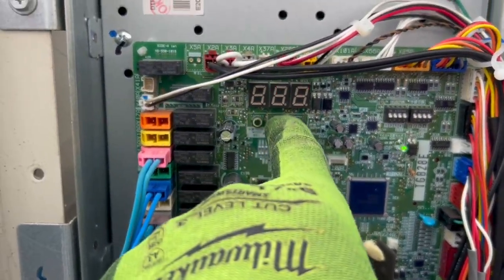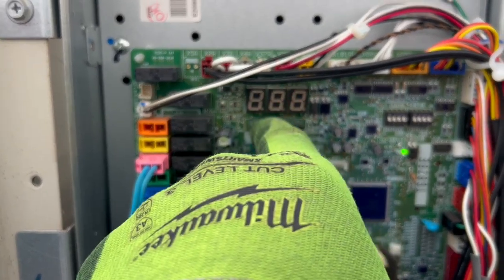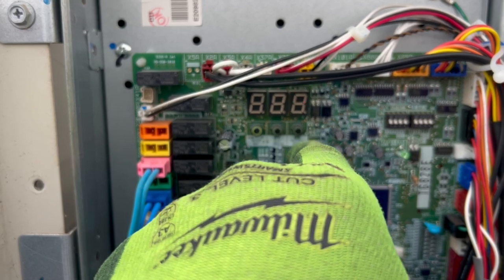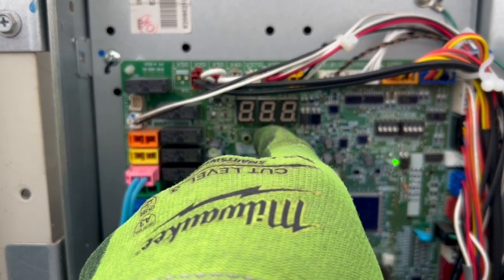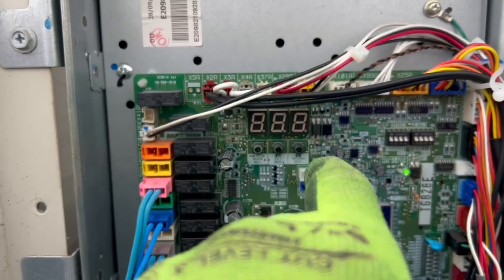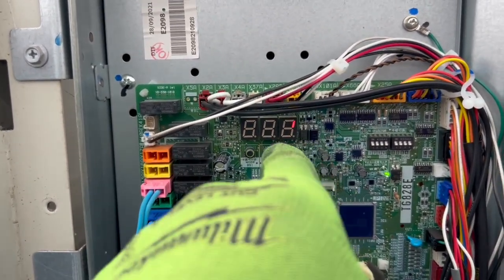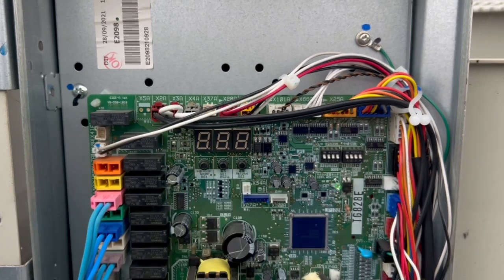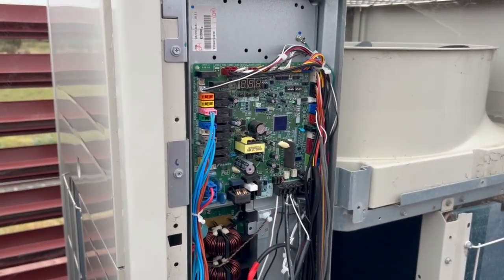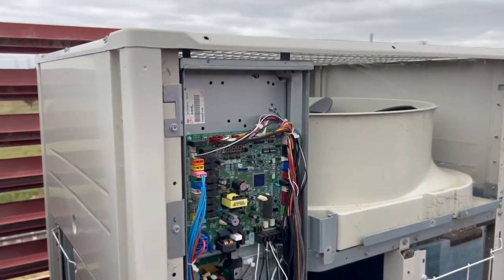On this one, that address is 9-9-2 - yes, okay, so this is the one we're looking for. While I'm here: mode 1-10, number of indoors expected is 10, and we have 11 present. So 1-10 is the number of indoors and we have 11 present. All right, we're looking good. I'm going to run this thing through a test mode now - actually I'm going to have to put the cover on first, but we're going to run this thing through a test mode and get them all running in heating mode.